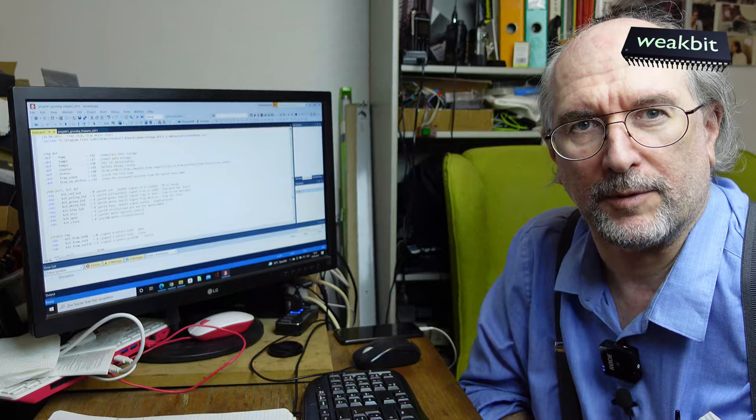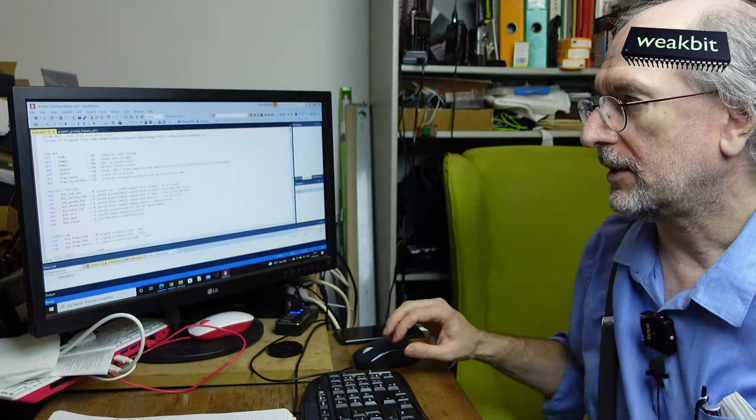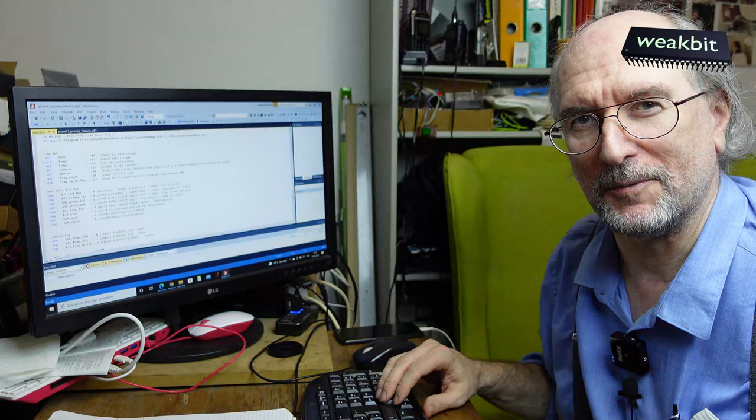At the Grundig CD11, I have the problem with the tray. The tray is going out and then the motor doesn't spin anymore, because the program that controlled the motor out is stopping to work. Now I came to the idea, if this can repeat every time for the going out, so I take a microcontroller, and in the last days I wrote a small program that will fix this issue.